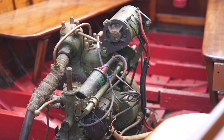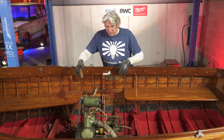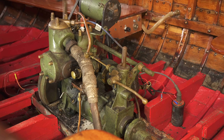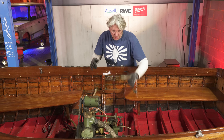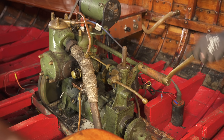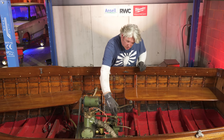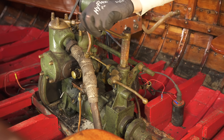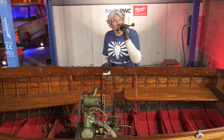Another element of this design, which is beautifully simple, is this little handle here. As I mentioned earlier on, you've actually got this shaft going through the length of the engine so you can actually crank it over, and it's got a little ratchet on there as well so you don't get dragged around with the engine when it actually starts. You could do the same thing from the rear of the engine as well. But you can use the same lever to go forwards and backwards — by moving this lever backwards and forwards you can actually go ahead or you can go astern. A lovely, simple mechanism.